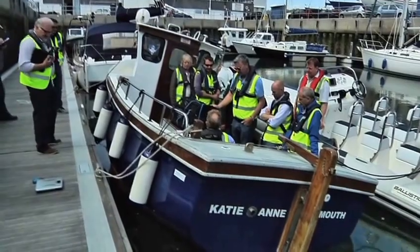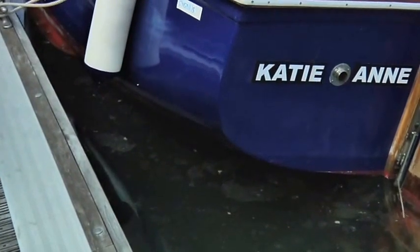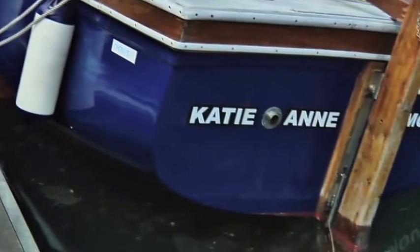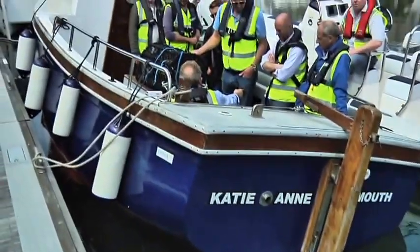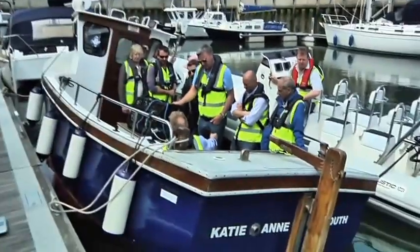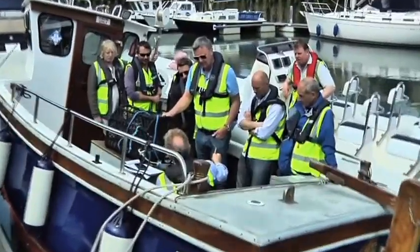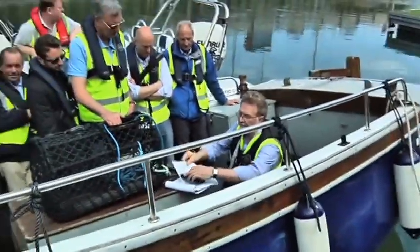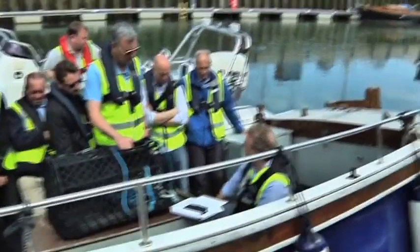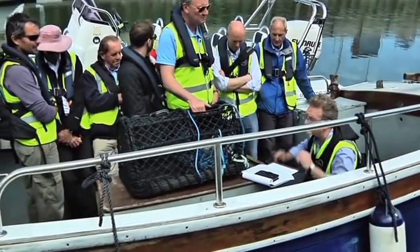So the normal permitted heel angle is 7 degrees. In certain circumstances, you're allowed to go to 10 degrees. And those circumstances are if the freeboard on that lowest side when the boat is heeled over is equivalent to the required upright freeboard. So that makes sense. When the boat's upright, with its continuous weather deck, it's got to have 300 millimeters of freeboard. What have you got there, John? What did you say you measured? 475. I wrote it down, didn't I?